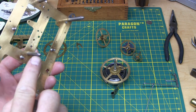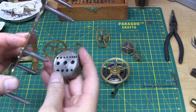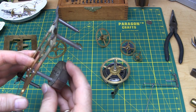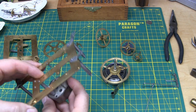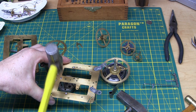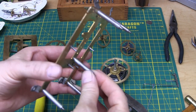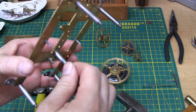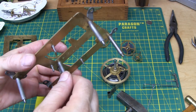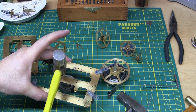I don't think that post is supposed to move because when you tighten up the screw it can just go around and around. So I'm just going to tighten that up a little bit. I don't want to bang on the tip of this — that'll just flare out and you might not be able to get the nut on. I'm seeing which hole I can put this in and still have the shoulder showing. It hits the shoulder there. Now it's tight and not turning around — just a little peening on the end of this rivet keeps it from turning.